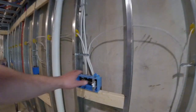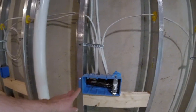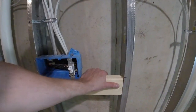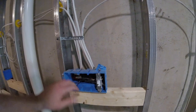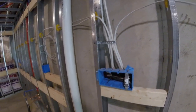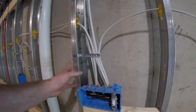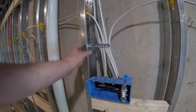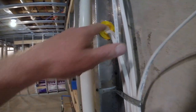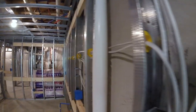When you're installing your electrical in the steel stud scenario, it changes a little bit. You have to screw your boxes to the steel rather than nail them in. And then you have to put in some blocking to provide rigidity to these boxes so they're not flexing all over the place. The way you fasten wire to the stud is a little different — you use these devices instead of a staple. And you want to use these bushings to make sure the wire doesn't rub on the stud.